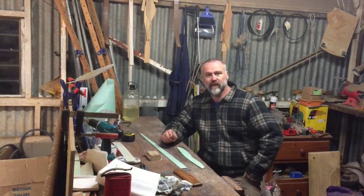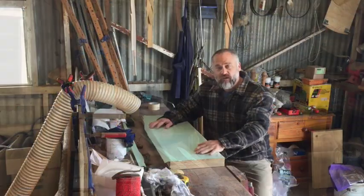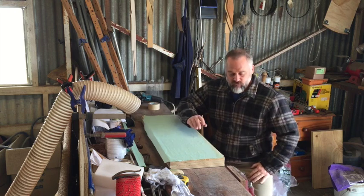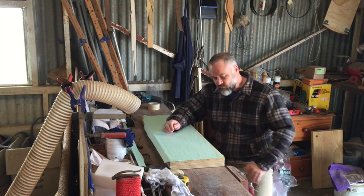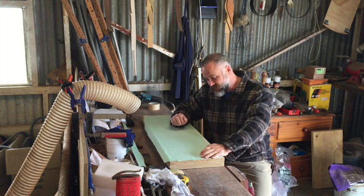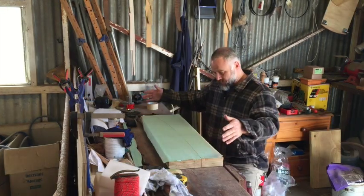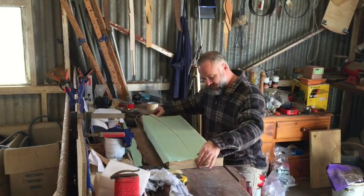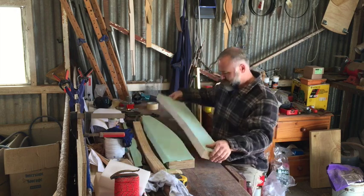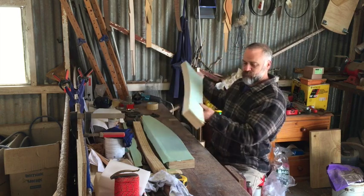Next I have to make the mould that I'm going to glue the limbs up in. I've got my mould here — it's about 50mm and I've glued it together with four pieces of plywood. I transferred the shape I want the limb to be onto the mould, drew it onto paper, cut it out, and what I'm left with is the bottom mould — the shape that I'm going to have for that limb.